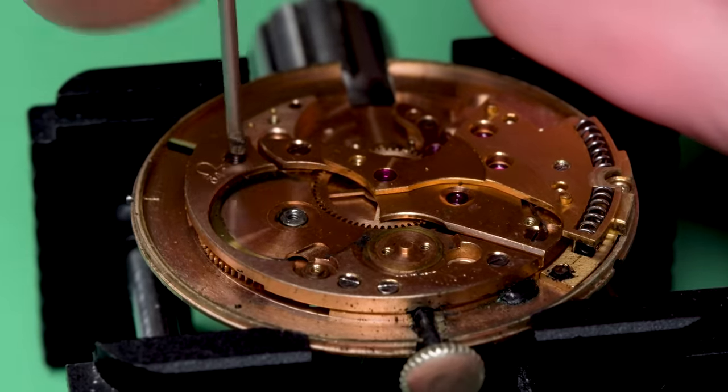Let's put the balance back on before we get the watch ready for the cleaning machine, mainly just to protect it. If it's attached to the main plate it really can't get damaged — no room for other parts to get in there. I always use a little bit of air to make sure it's spinning freely, which lets me know it's mounted properly. Now we need to take apart the mainspring barrel, which has the mainspring and the arbor inside. I kind of expected this to be pretty dirty — and it does not disappoint. That is confirmed pretty dirty.